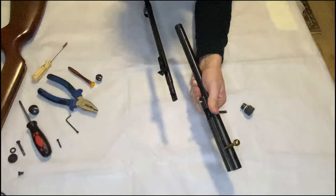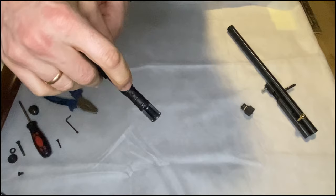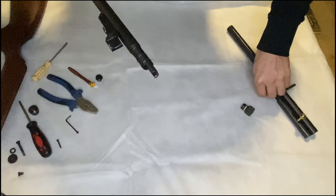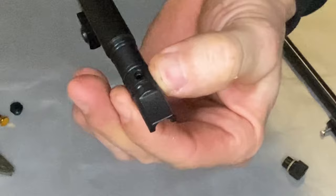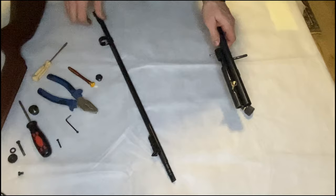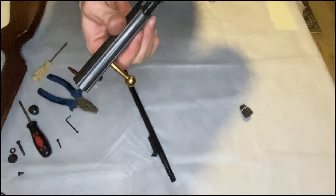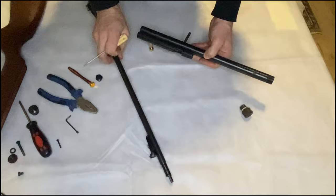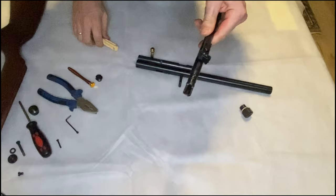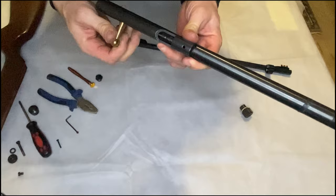Slowly, slowly — let's remove the barrel with small movements. So here we have O-rings. So if I don't put this bolt here, look what happens — this part is already not sealing. And how it's working: here we have the receiver, here we have a valve — from this side CO2 is coming, onto the barrel through this hole. I will disassemble the bolt so you will see how the bolt is made.